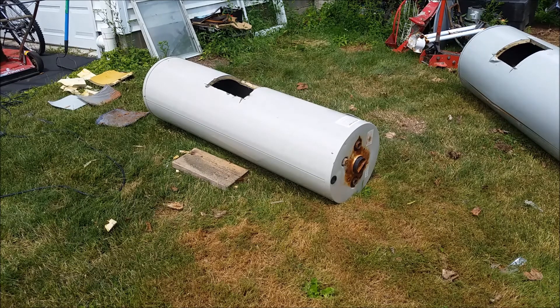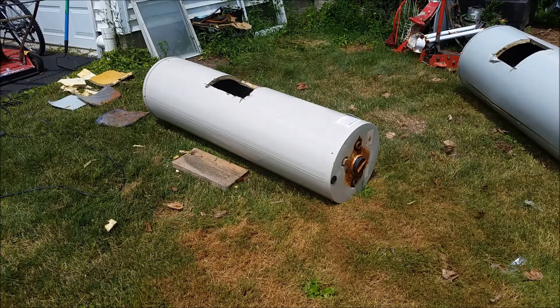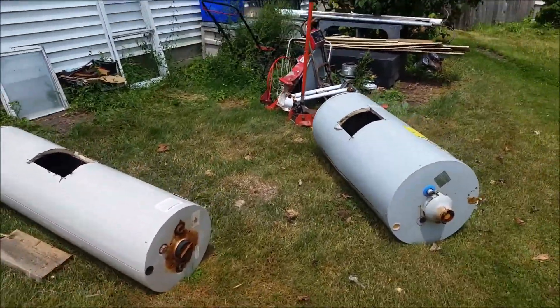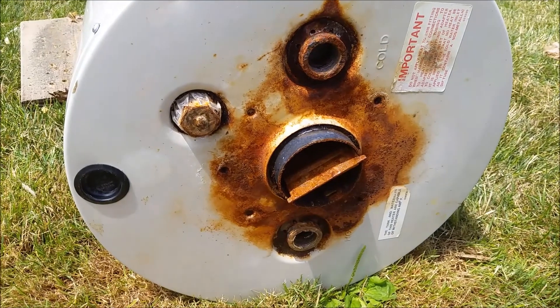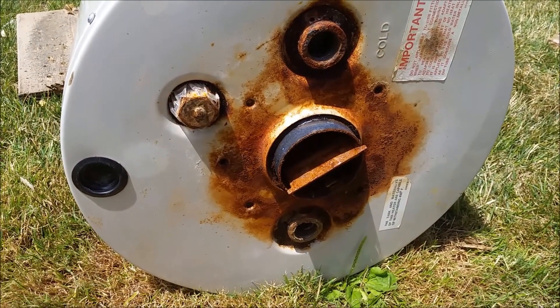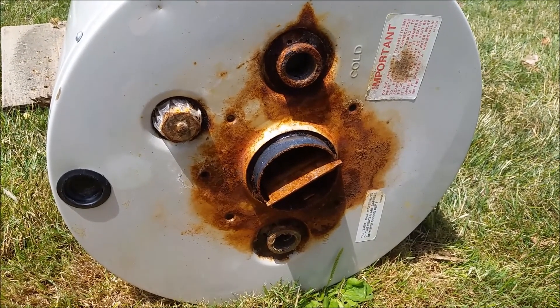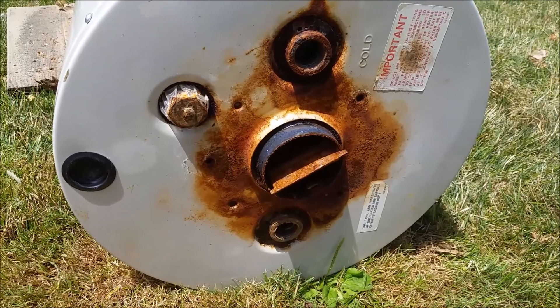Maybe it was better taken care of. I did try to flush the tank on a pretty regular basis — realistically it probably averaged about once every three to four years, though you're supposed to do it every year. Another thing I wanted to point out is this rust spot on the top of this tank. I was told this is because the chimney was not venting properly. When I first purchased the house there was a bird nest in the chimney that had to be removed, and I suspect that caused it. The chimney has been clear ever since, but I think the damage was already done. If you see that rust spot, that means your chimney is not venting properly, so you better take care of that. Thanks for watching, everyone.